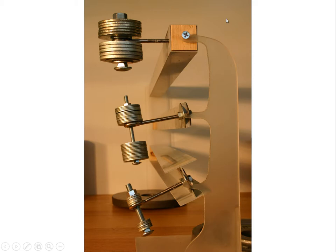You may recall in chapter one, we actually showed this experiment. We have three different sections here, which were made out of equal amounts of 1/16 inch thick styrene sheet. On the top, we have a square tube. On the bottom, we have an I section that has exactly the same amount of material in it. And then here we have the same amount of material consisting of several layers laminated together. And one of the things you'll notice is we've put the largest offset force on this square tube.